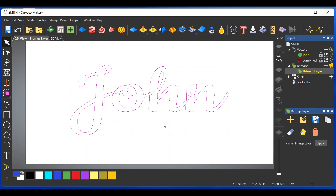Looking at John I can see some problems with the text — there are some overlaps right here, right here, and right here. In this case that's a simple fix: click off of John, click on those overlapping vectors, push Delete. Go to the next one, select it, push Delete. Go to the next one, select it, push Delete. Now you have John corrected with all the vectors. Hit Group so they stay together.